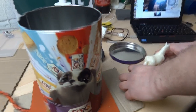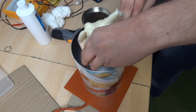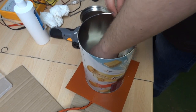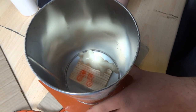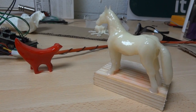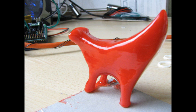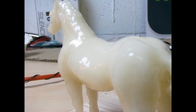Let's put the horse back in and give that a few more minutes. So far, how long have they been in there? We put them in at 20 past 9, it's now 20 past 10, so they've been in about an hour. And a 0.4mm layer height apparently needs more than that — it may just destroy all of the surface detail completely; I think the ears will probably be gone by then. So the heated bed is still on. You want to start with the finest print you can do, really. I've seen some good results at 250 microns. Here's the finished product: we've got the red Superluminal banana with a 250 micron layer height — it's come out nice and smooth after one hour. We are now an hour and a half in, and the 0.4mm layer height, 400 micron horse, is not quite flat.